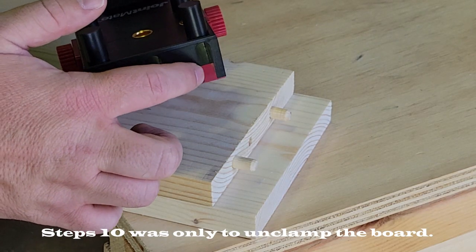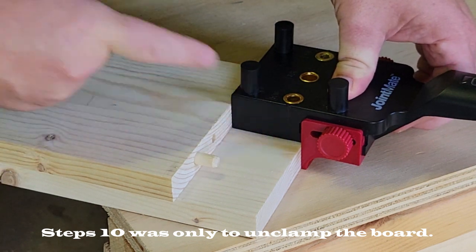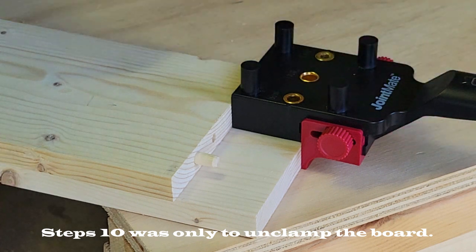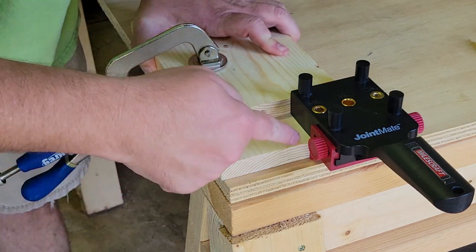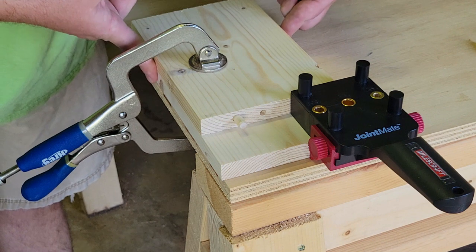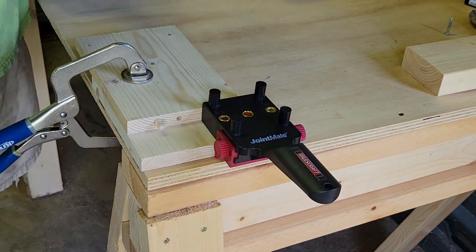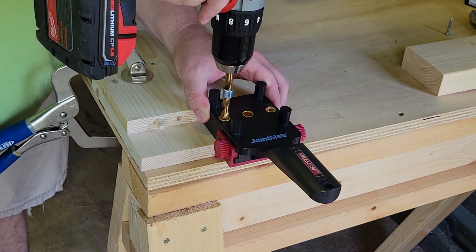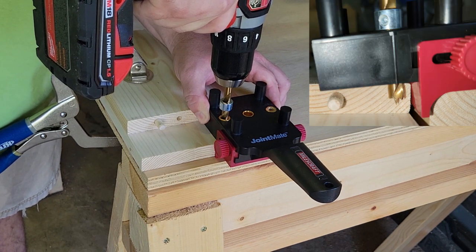Step eight, find the right bushing and slide it right over your dowel. Step nine, take the fence, put it flush up against the board, tighten it down. For step 11, you get the appropriate slot for the size dowel you're using, slide it over the dowel, and push the whole thing until your fence is touching board number two. For step 12, you're just making sure everything is aligned how you want it — boards are flush if that's where you want it to be, fence is up against board two, and get it all good and clamped down. It might be a good idea to use clamps going this way as well, just so nothing shifts. Steps 13 and 14, you start on one end, make sure you're good and snug, put your drill in the appropriate bit hole, and just drill your hole. Now is a good time to make sure one more time that the drill bit won't go all the way through.